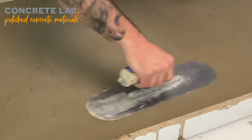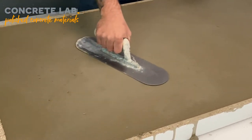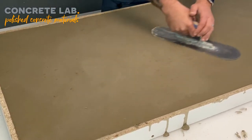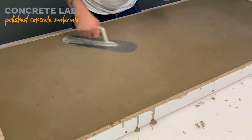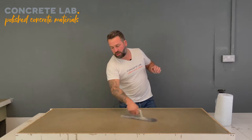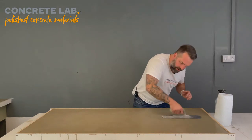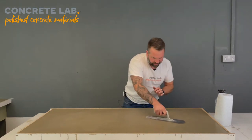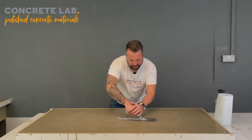No paste on the bottom of the trowel as yet, but keep watching out for it — as you move it you'll find spots will begin to stick in some places, and that's where you're getting paste build-up on the bottom of the trowel. It might be that just working between that area and a different area moves that paste around, and ultimately that's what you're trying to do: evening out the cement paste on the surface and getting it all smooth so any lower spots are filled in.